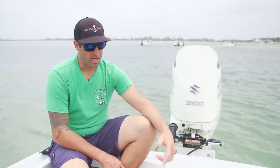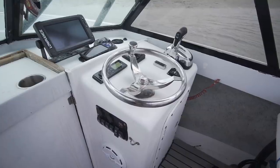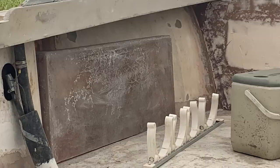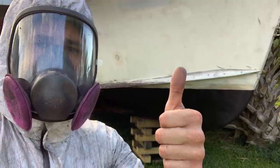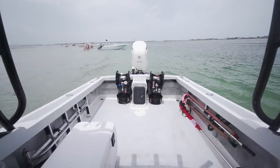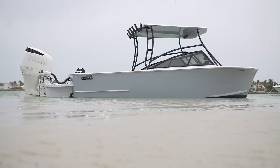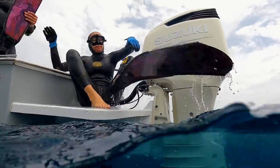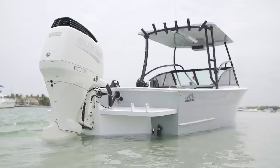After I got all the glass work done, I popped the mold for the knee and the strut for the back. The dive tank racks, the helm, the console - I never made a mold for anything like that before. I worked with a lot of wood, melamine board to make the mold, wax mold release, all that stuff. Then it was a ton of sanding and fairing. I wanted to make sure the boat looked good from the outside. The inside is down and dirty - things are going to be slamming down on it, spear shafts, tanks, stuff like that. The outside is all grip paint, medium gray. Then it was off to the bracket and the hardtop. I wanted a big platform to put divers on, to swim up on it, and have enough volume on the back so that coming out of the hole it's got ton of volume and space in the bracket, because it's going to be loaded down with dive tanks.